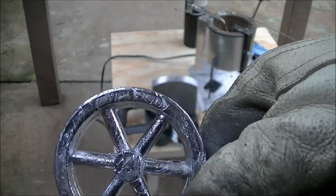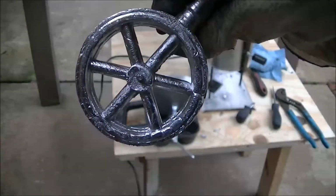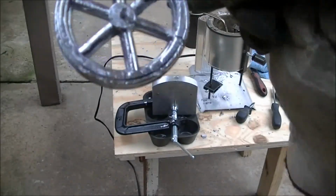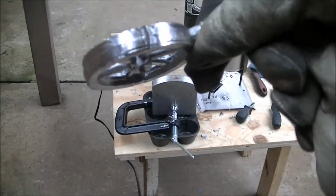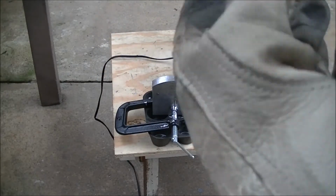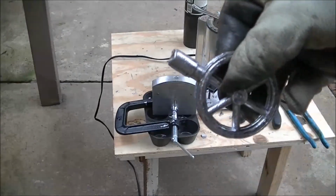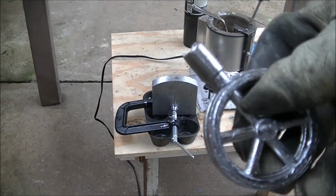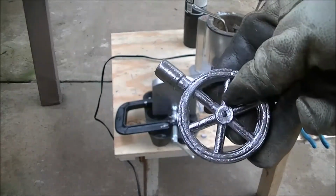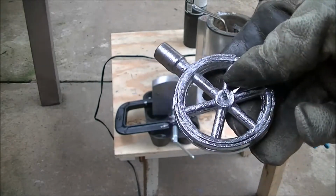Okay, I've gone through a whole lot off camera, but this looks like a pretty perfect flywheel, except for, you know, machining the edges of it nice and smooth. And this was with the mold cold. Actually, what I had to do was go back and make the hole where the sprue is a lot bigger. By the time I was pouring my second ladle of stuff in there, the stuff inside had already cooled down, and a lot of it was running over the side instead of going inside.